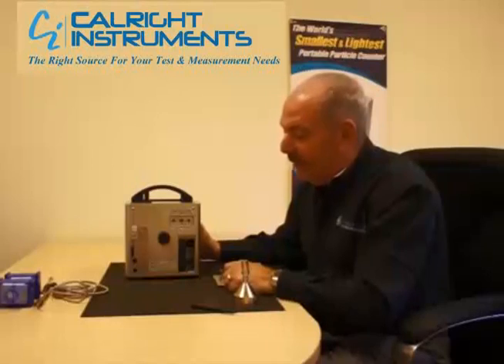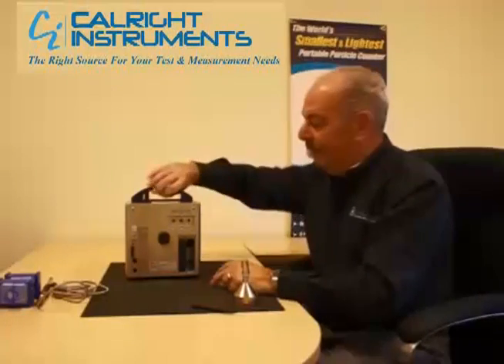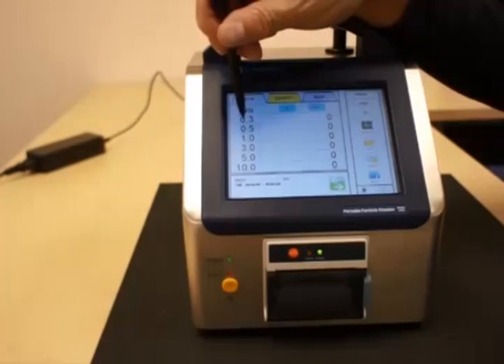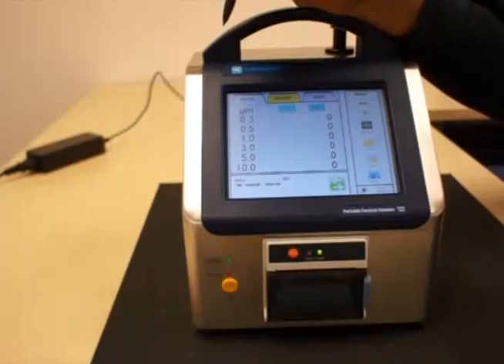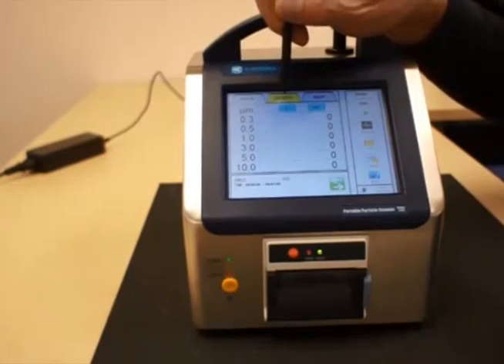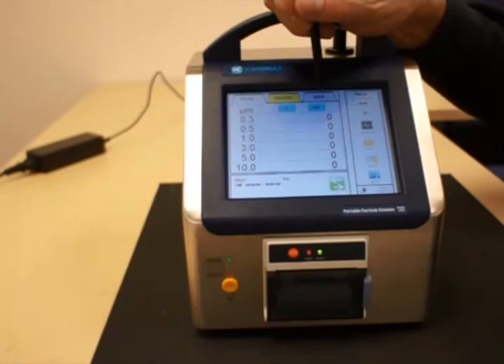The unit can also be integrated into a LAN for remote operation and data access. The intuitive menu of the 3905/3910 series is extremely user friendly. You can see the list of six particle size channels that this unit will count. The data can be represented in a data format, a graphic format, and there's a map tab where you can load a JPEG of a map. In the isokinetic measurement mode, you can have individual measurement points identified to locate the particular points required in your ISO standard.